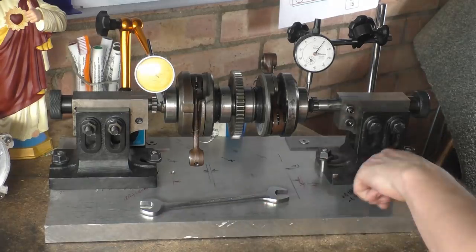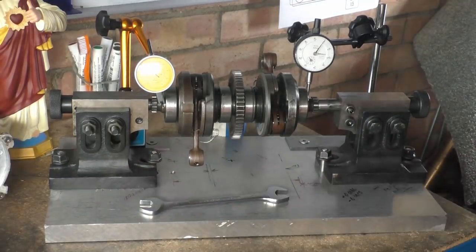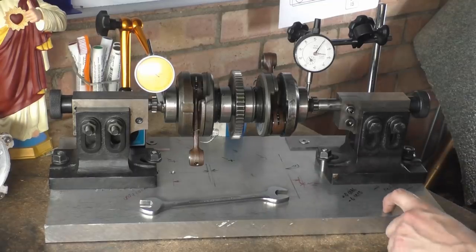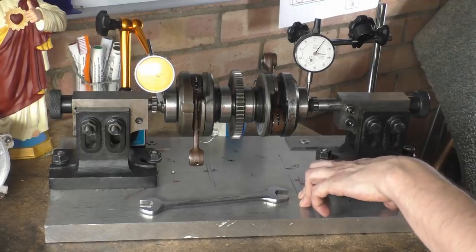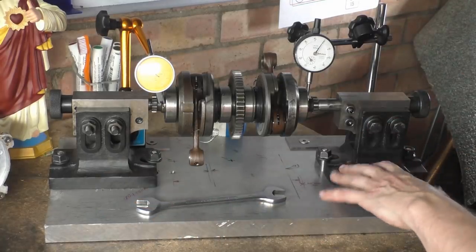These are just two centers for milling machine tables, the kind you use when you do rotary indexing. The way this works — I'll probably put some pictures up — this is the static side. There are slots in this that you can't see because the stands are sat on top. This is about an inch thick piece of aluminium, I think 6061, and it's got slots that go up and down, plus some extra holes that have been added over the years, and these are keyed.